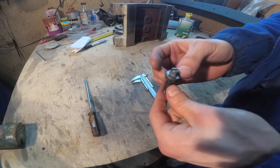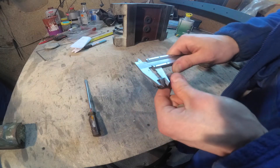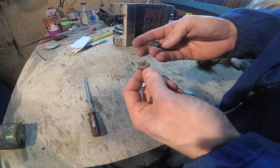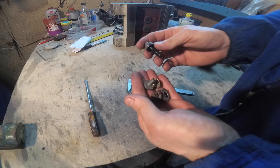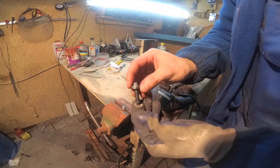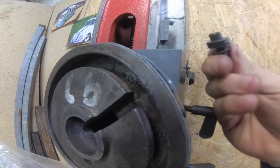I need to correct this adjust screw - this is the screw from the headstock saddle gib. As you have seen, this dimension is too small, this part is too tight. It's 6mm but I need something about 7mm or 7.5mm. I think I found some shims and washers and screws, I will use one of these shims and fit it here. This looks better - perfect fit, it is very tight.